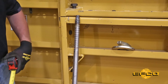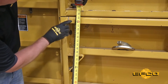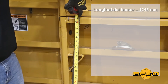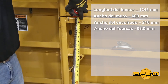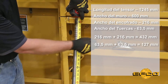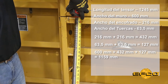The first step with figuring your dimension for your wall is to measure the length of your taper tie. Right here you can see that we are at 49 inches, and the width of our wall is 24 inches. The width of the form is 8 1/2 inches, and the width of the wing nut is 2 1/2 inches. So if you double the form width, that gives us 17 inches, and double the wing nut for one on each side is 5 inches. So 24 inches plus 17 plus 5 equals 46 inches.